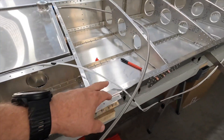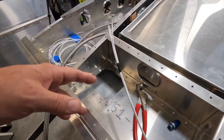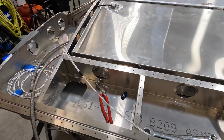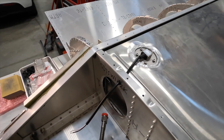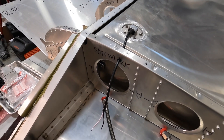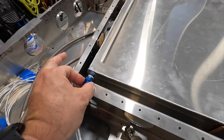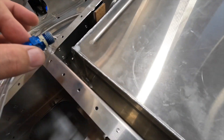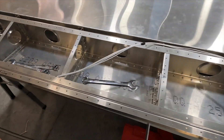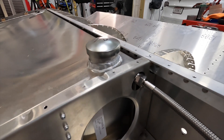We could redirect the wiring up into the wing rib area like we were going to do with the vent line and run it down, but eventually you've got to figure out how to get it to where it needs to go on this end — you're just moving one to move another somewhere else. I also put a grommet in here for the fuel level transducer. This wire will come across and through here, we'll do the ground wire, and then we'll have our lead wire to go to our fuel gauges. You have to put your fittings in after the fact because you cannot drop the tank in with these fuel fittings on. So just know that when fitting up your tanks, you have to fit the tanks in first and make sure your holes all line up on both sides, because you have fittings on both sides that have to line up with holes. This hole you actually have to make yourself; the other one is there from the factory.